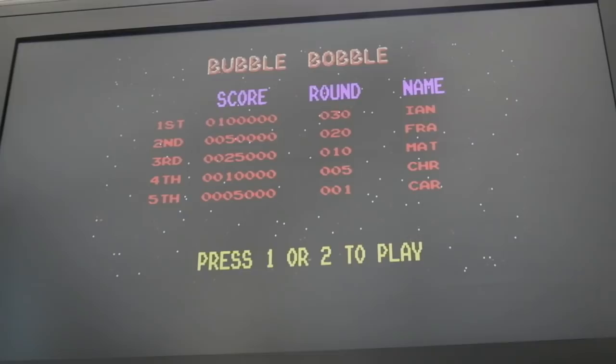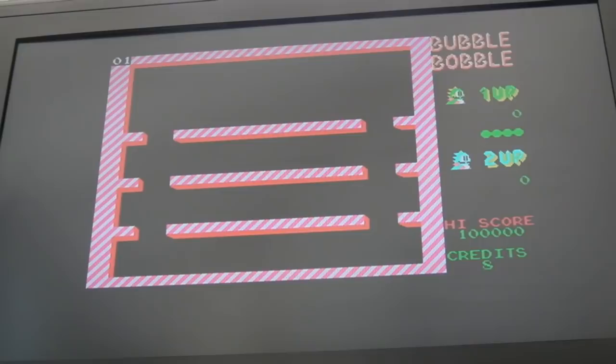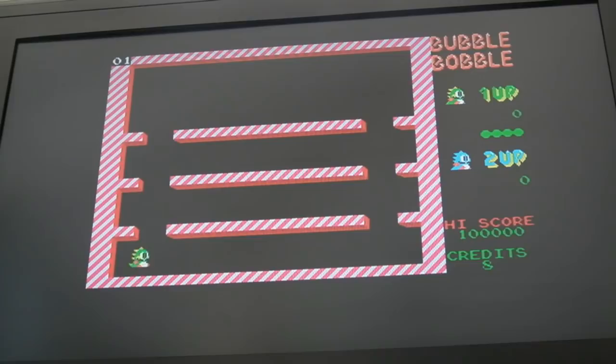You notice that the video, so the fade is slower here. Is it because I've only got 1 mega chip RAM, maybe? I don't know, it could also be because I'm using the TF520. But this game now behaves normally, except for that slow fade in and fade out. But that might be normal on a 500 or a 2000 when you're using pretty much stock specs in terms of processor. Yeah, it's a bit slow there, fading in. I'll test it on the other 2000 board at some point just to see if it behaves the same way there.